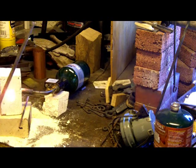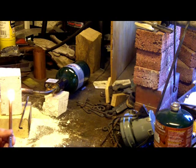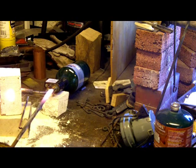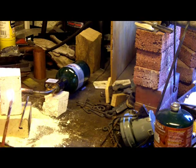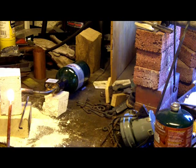This is about the size that you might run into for rebar. As you move these pieces in and out, they'll scrape away bits of the brick. So if you're always working this 5/16ths, what will happen is eventually you'll wear a 5/16ths groove out of the end. And here we go — 5/16ths orange hot. I'm not sure how hot the center is, but if we leave it in for a little bit longer we can be guaranteed that it's hot all the way through, so that when we take it over to the anvil the entire piece will move under the hammer and we're not working against a cold core. But for proof of concept, I think this works.